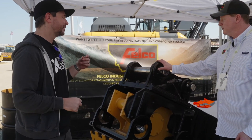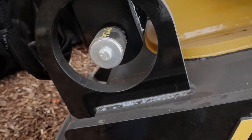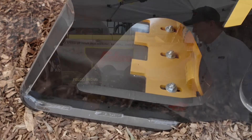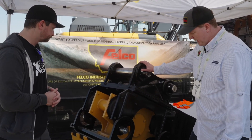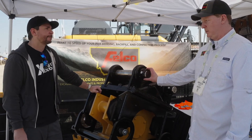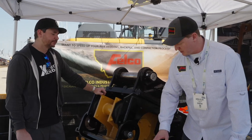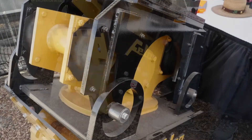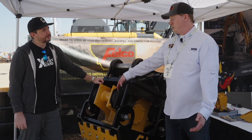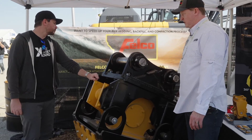When you put this on the machine for the first time, the operator's brain immediately starts thinking about all the things they're going to be able to do with it and how it's going to save them time. In terms of maintenance: with any of our products, make sure you don't have any leaks. We don't do daily maintenance in how we build things — we like to keep operators as efficient as possible, spending less time working on the tool before you can work. The steel journal bearing axle doesn't need to be greased daily — it's got a five-year warranty. Change the oil once a year with standard 30-weight oil and you're good to go. For the vibratory compactors, you have to replace the isolator pads when they wear out, but you should get a year or two on those. Past that, unless you have a valve malfunction, there's not much you have to do — you just plug them in.